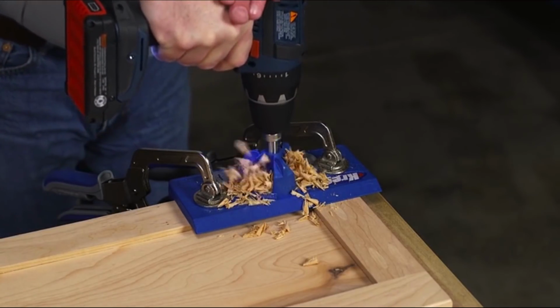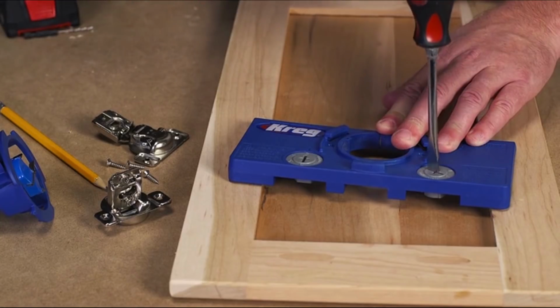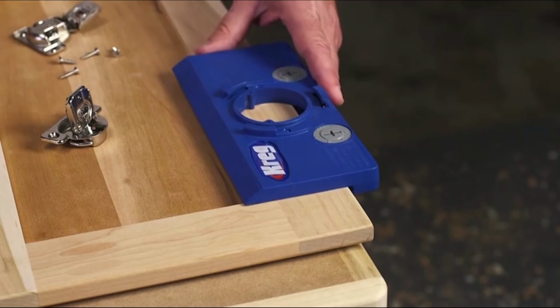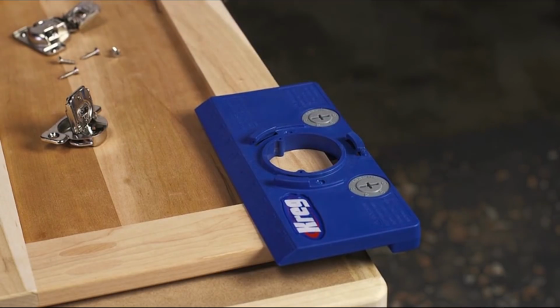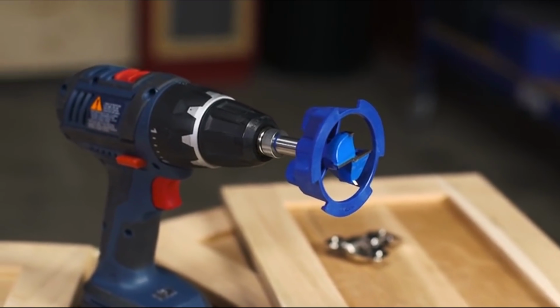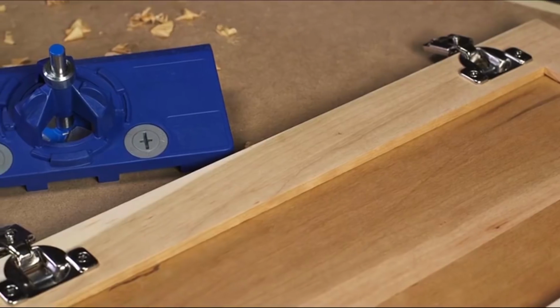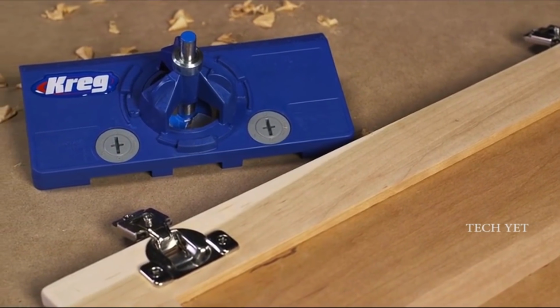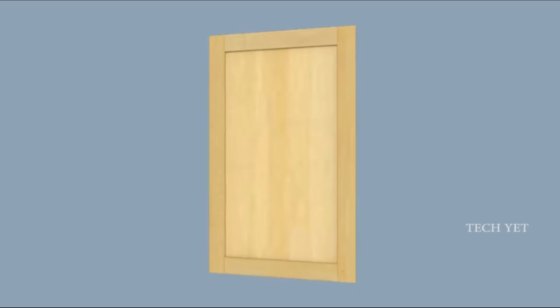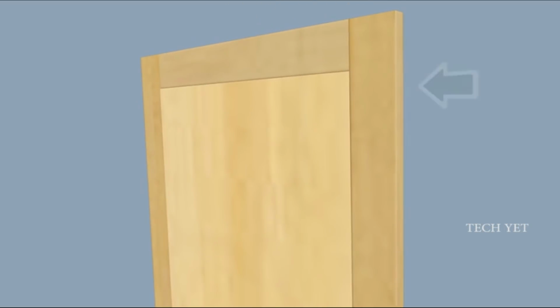than an ordinary drill. The jig makes the process easy, thanks to indexing cams and built-in measuring scales that ensure exact hinge cut positioning, plus a removable guide for the included carbide-tipped bit. Using the concealed hinge jig makes it simple to figure out the 2 main things required for mounting these hinges: determining how far from the door edge the hinge needs to be located and how far the hinges sit from the top or bottom of the door.